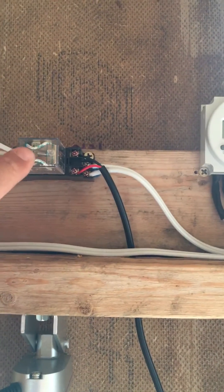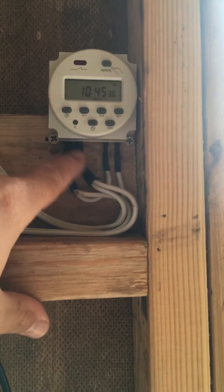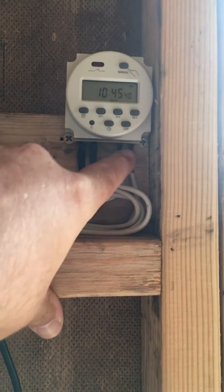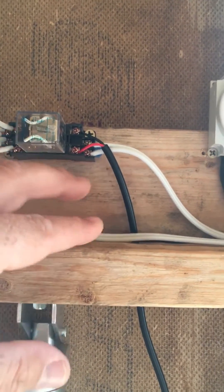The second timer controls the coil inside this relay, which will reverse polarity. When this timer's on — temporary manual power — same thing here: power supply comes in, positive and negative power to the switch built into here. When the timer kicks on, it comes back out of this wire, runs back over here, flips this relay, which reverses the polarity, and makes the motor go down.